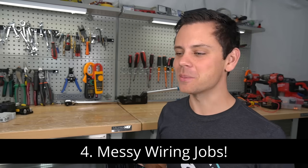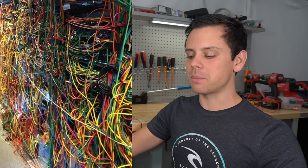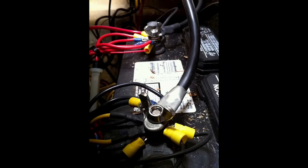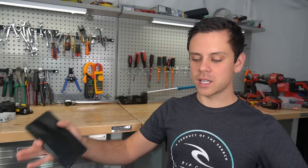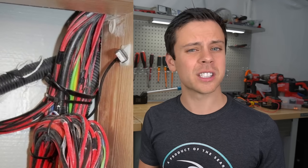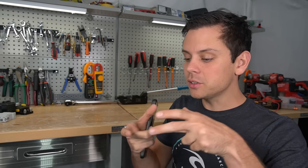Number four is messy wiring jobs, and this is crucial. I've seen people build batteries with a nest of wires on top of all exposed battery terminals — that is not safe. Also, having more than three lugs to a single terminal is not ideal. You need to space your stuff out and organize it; you should be able to see every conductor, and if you can label it, that's even better. Bundling too many wires together with zip ties is also a problem — if you have lots of high current conductors wrapped together, they will not be able to dissipate heat as designed, which can cause fires, melted insulation, or hot spots.